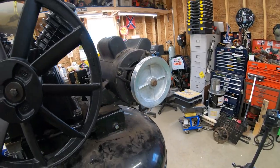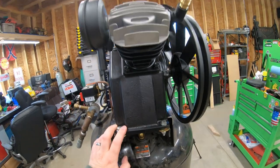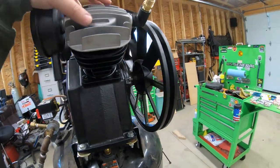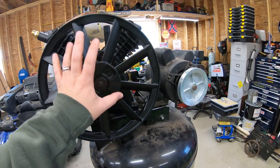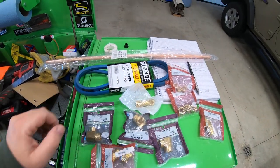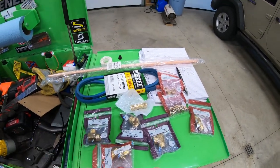It is the end of day — going to pick this back up tomorrow. So it's the next day. Where I left off last night: I got the compressor head mounted, pulley on the motor, everything secured down. I'm back to finish it today. I'm going to run my copper line from there to there — that'll feed from the pump to my tank. I'll install the belt. I used a formula I found online, and with 11 inches center-to-center, the belt needed to be 51 and three-quarter inches. So I went with 52. All this stuff here should take care of everything I need.